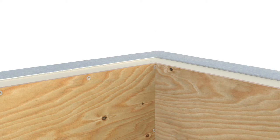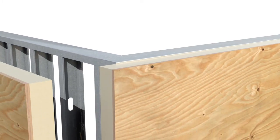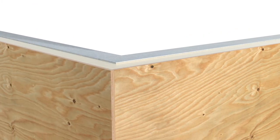When installing your Hunter Xci Polyiso wood composite products and you come to an outside corner, you will cut back the foam from one of the two panels so when they butt together, the plywood or OSB covers the foam edge of the other panel and the wood butts together, not leaving any polyiso edges exposed. In both corner installations, cutting miter corners is also an option.